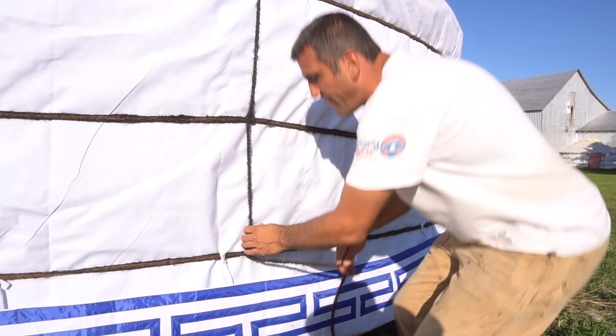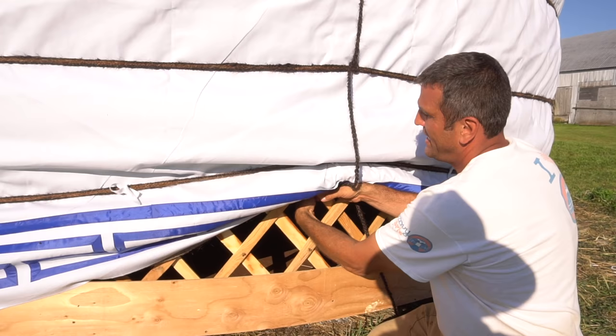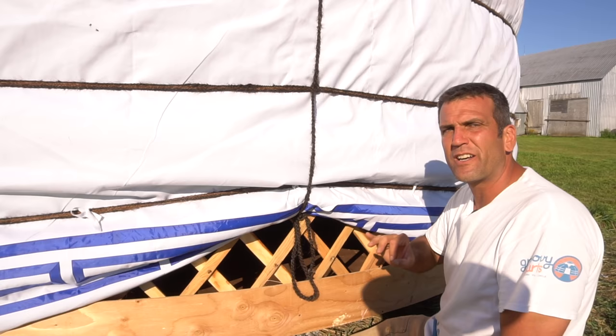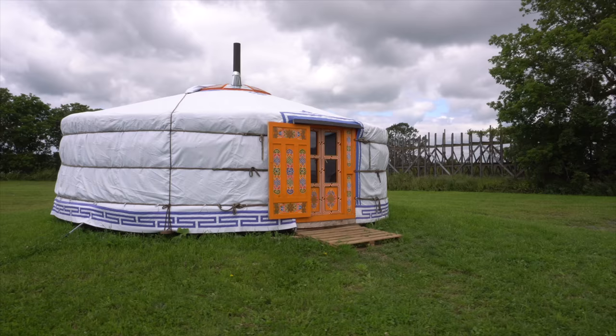There's a very easy way to ventilate your yurt in the summer — that's how Mongolians do it. They will roll their covers, take the rope coming from the top, and create a gap. You can do that on three sides and you will see it's almost like air conditioning — it really cools the yurt down, creating a natural draft with the dome. If you place mosquito netting here at the beginning, that will stop any bugs coming in.